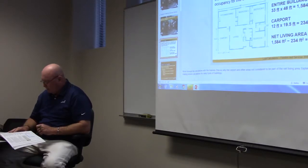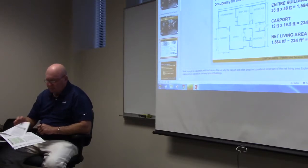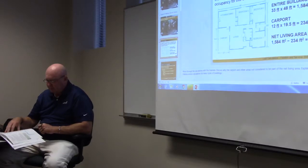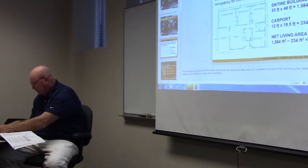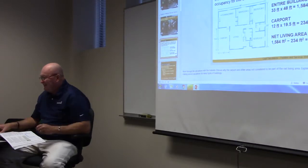Number 19, the minimum size service for a dwelling is determined by dividing the total calculated volt amps by the blank service voltage. Line to line. Okay. All right. You agree with that, Nate? Yes, sir. Okay. Line to line. You agree with that, Cameron? Why not? Right. Okay. And that's it for that.